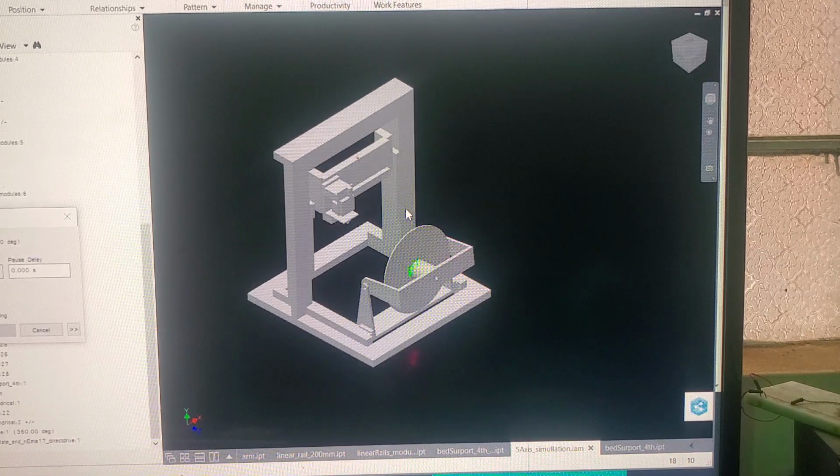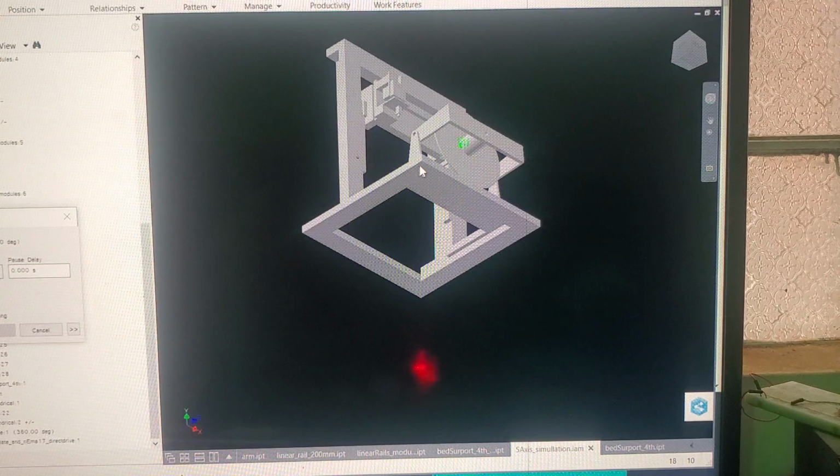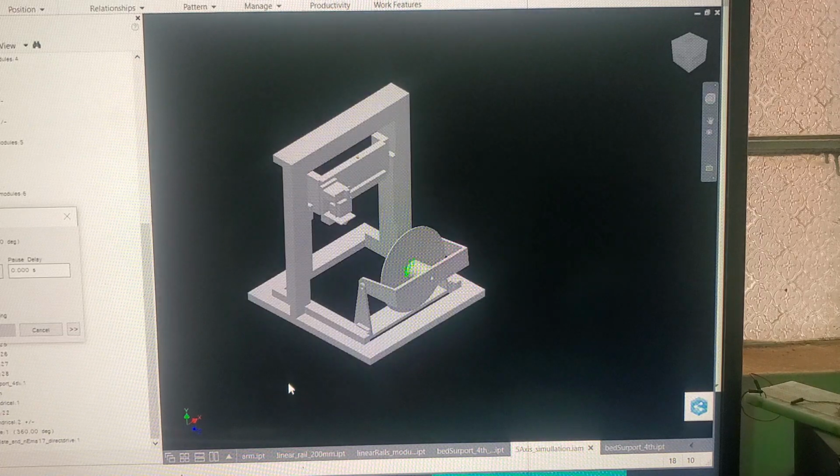It will be cut as an L-shaped, no, as a C-shaped because of strength, because as you've seen in this printer, it's warping this way, it's shearing along these lines. And then here I'll make it thicker. I'll add another, this was just for simulation, but add another wood here at the bottom, and then another one here, so it will act like supports and steel as a new base.